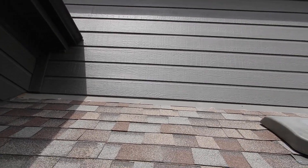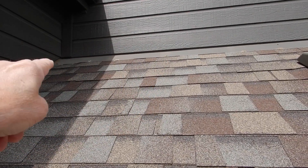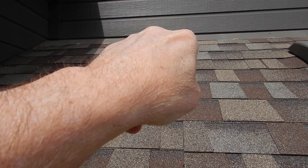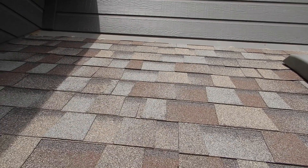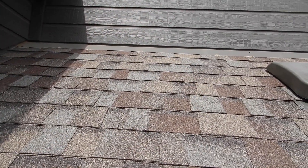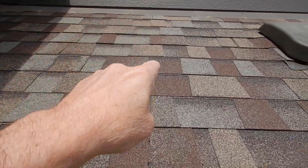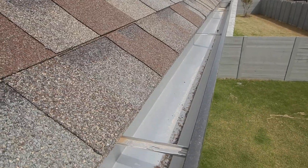As we watch, the wall comes down but behind the wall is apron flashing, and the apron flashing comes out from behind the wall and goes on top of the shingles, so that water cascades off of the wall onto the shingles. The shingles are installed so that water cascades over the tops of the shingles and goes into the rain gutter.